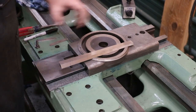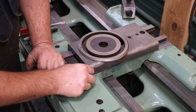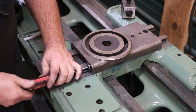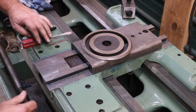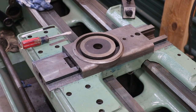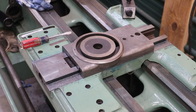I did some measuring and cut it to the same length as the old gib, which should give enough adjustment range. I'll slide it in, put the front screw in, and snug it up. That actually feels pretty good even without any oil on it — we can fine tune that later. Before fine tuning, of course, we've got to get it scraped in. I'm not really feeling any side-to-side movement, which tells me we've got a good taper. Hopefully that thing is going to scrape in pretty easy, but that's going to be another video.